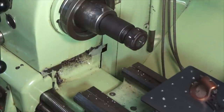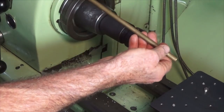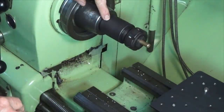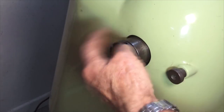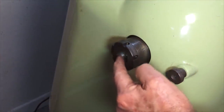Now, the other thing you might be asking is why do you need a draw tube? The answer is that I can pass a long piece of stock right down through the centre of the chuck and still be able to anchor the chuck in the spindle. When I tighten up that draw tube, it locks that positively in the spindle and there's no chance that's going to walk out as you're doing any turning. There's our draw tube nut — we can just tighten that up by hand, and then using exactly the same spanner we use on the collet nut, we tighten that draw tube up. There's a 20mm diameter hole through the centre of the nut, the draw tube, and the body of the chuck. So I can have up to that diameter material extending out from the spindle, and I can work with the full length of stock, making parts and parting them off as I go.